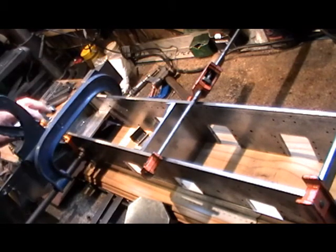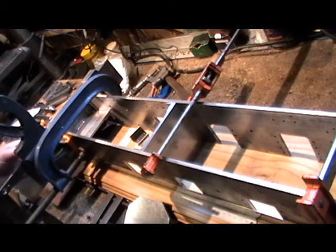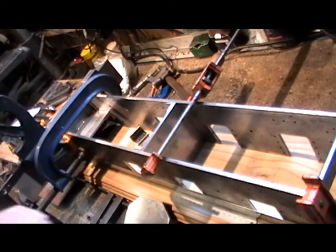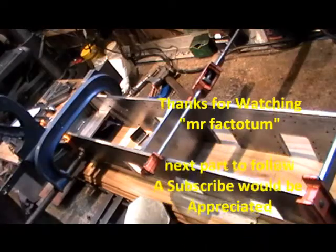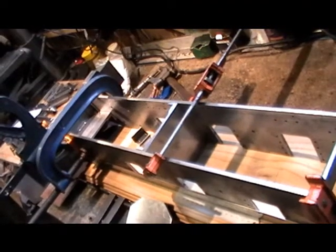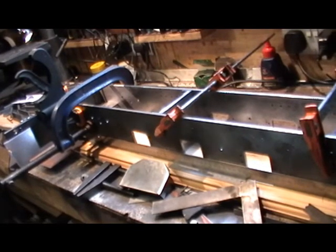My next job now is to take one of these angles off, drill it, put it back on, take the other off, mark the holes, drill that, and then I can rivet these angles onto my buffer beam. Then I can fasten my buffer beam onto my frames along with the stretcher - that's the front bit done. Then I'm just going to do the back buffer beam and put the stretchers in, mark all the holes off in the stretchers, and it's just a bit of repetitive work really until you've got everything lined up, marked up and drilled. I'll do another update as I get to a position where I need to show you something else. I'll see you next time.